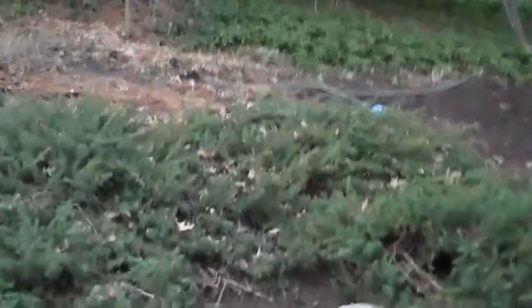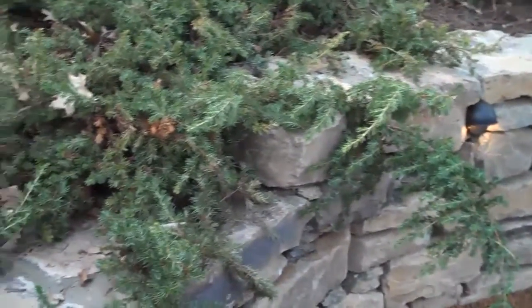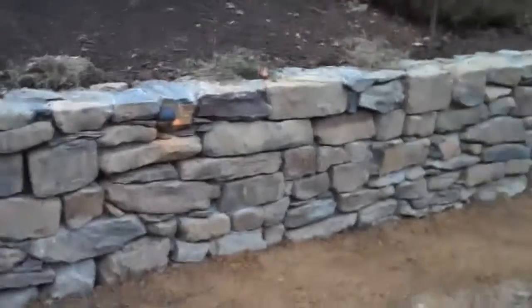The drainage pipe is buried, so when it rains and the water comes down the hill, it hits the drainage zone that we put behind the retaining wall, goes into the pipe, follows the pipe down to the existing system they had in place, and exits out in the street — alleviating a lot of the water pressure and the soil pressure behind the wall, so this wall is going to be here for a very long time.